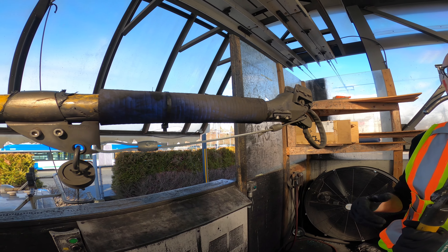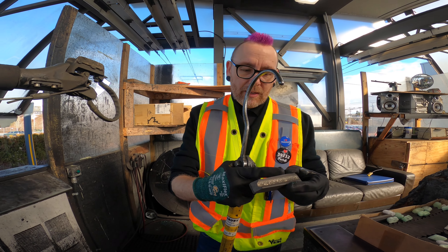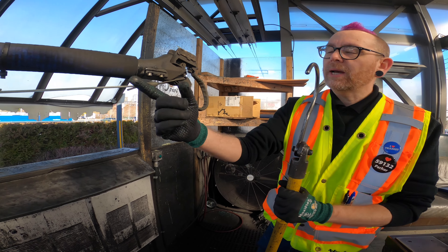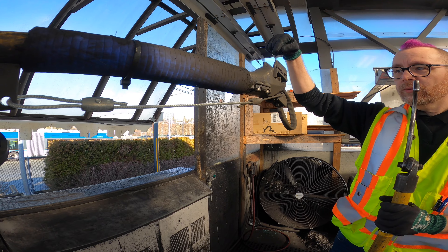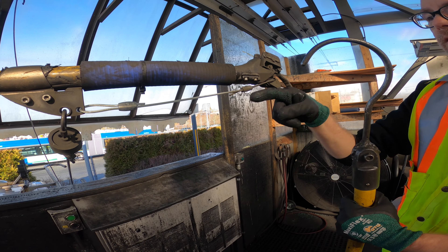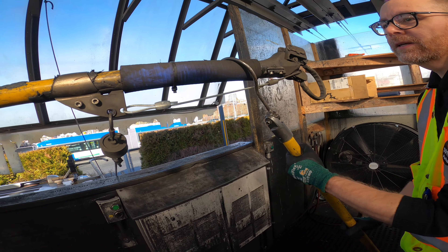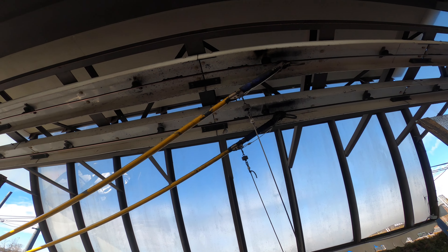What's the carbon for? This is what contacts the wire and gets the electricity on this pathway. When your carbon falls out of the chute, you'll be constantly wearing into the wiring. When they're done, they will put it back up on the wire.